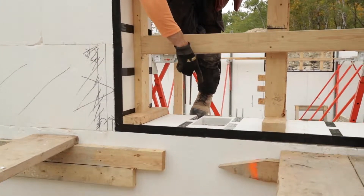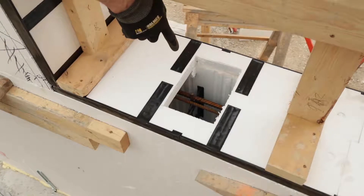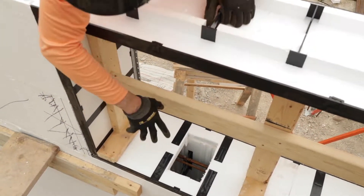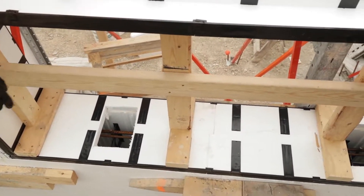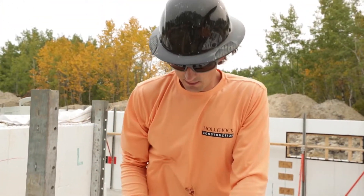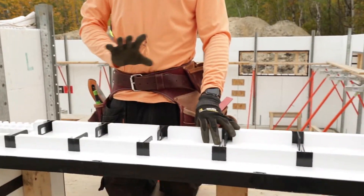We have our window cutouts for our concrete. When we pour our concrete, we can put the pump right in there, vibrate right in there, and make sure it flows right under the window. If it's not enough and you have a stiff mix, you can just cut out more during your pour. Go bigger than 5x5 — 6x5, whatever works for you. On top we're going to put two 15M bar, and then our last course.